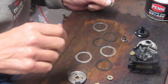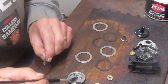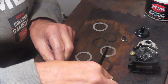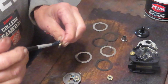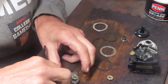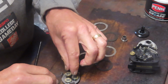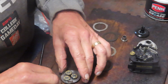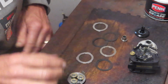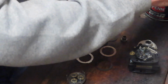So gears are next. I'm going to use a brush with some grease on it. Make sure we get some grease there, as well as on the shafts of these. And if I put the grease like that, when I put the gears on it, we'll push it down and grease the inside. Very nice well-made reel, very interesting concept. You can see how smooth this reel is going to operate, because instead of 1 main gear driving 1 oscillation or pinion gear, you're going to have the 3 gears drive it, and those 3 gears are going to mesh right with the main pinion gear right there. All right, that's this side of it. And actually, I think what we can do now that we've cleaned this up, we can put the grease on the outside track here.